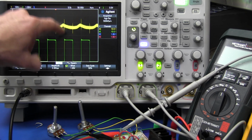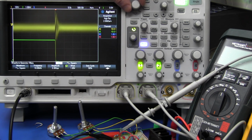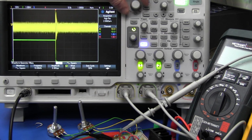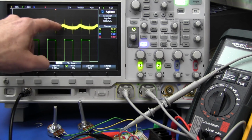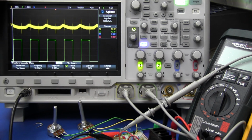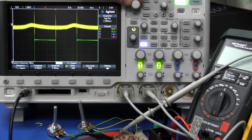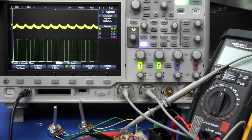And look at this little high frequency stuff in here. Bit of ringing there. That's probably due to our probing and stuff like that. But you really want to get rid of this sort of stuff. So that's not adequate ripple. If we just used that 159 hertz filter there, that's really no good at all. I don't like that one bit.